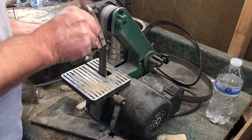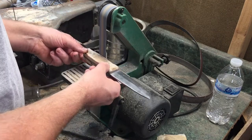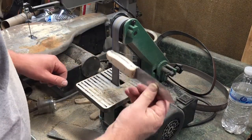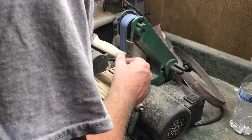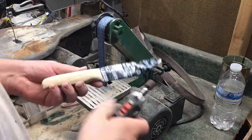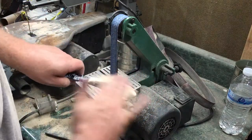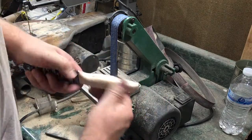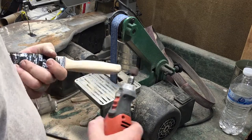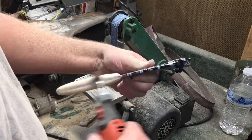It's back to the belt grinder to sand and clean things up. I used a lot of different methods, both on the belt grinder and with some other tools, to really craft and shape that grip the way I wanted it. For me, the key is just to take my time, kind of test it in my palm as I go, and see what feels right. I'm being really careful to stay away from that blade — that's why I more or less shape the parts of the scales that would be in contact with the blade end of the tang first. That's important because otherwise it gets really difficult to find the right tool to get in there and sculpt that part of the handle.